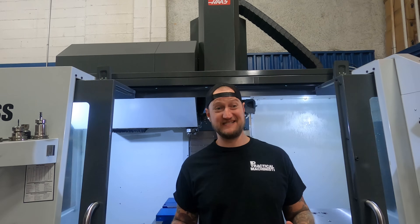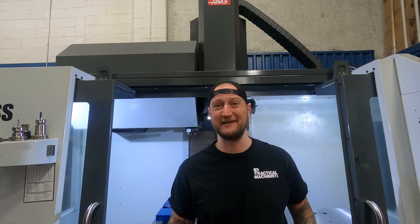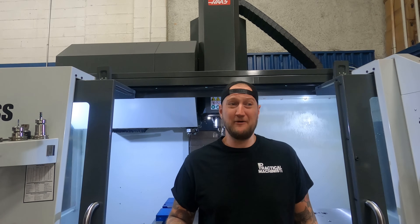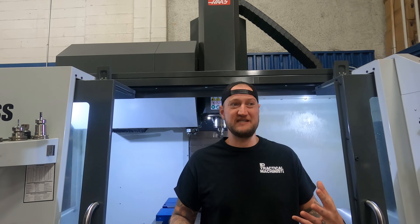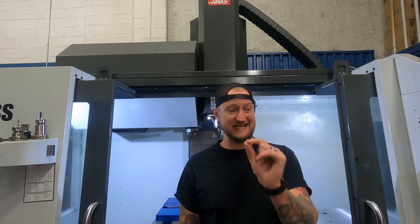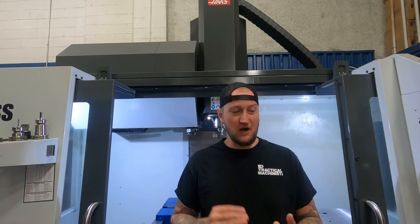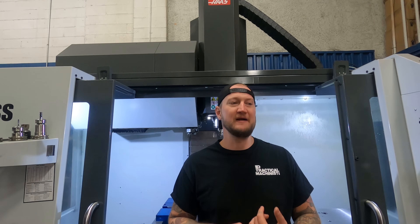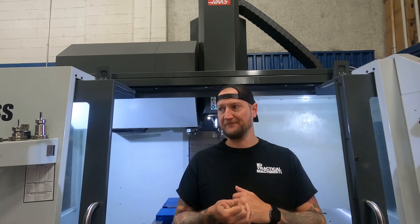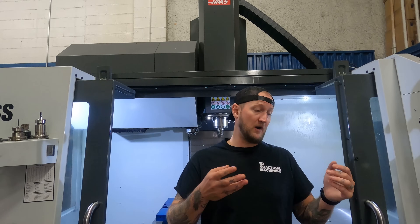So there you have it guys - I hope you enjoyed this. This was a very, very crazy result in my opinion. Thank you Iscar for providing this super high-end tooling to make this happen. But it goes to show - when I got the speeds and feeds from Iscar for these, I thought they were optimistic. In a standard tooling application you can always get these speeds and feeds, but whether they actually survived the tool test or not is a different thing. And clearly we can see they did - even that one insertable with those tiny, tiny inserts. I was shocked at how quickly that went. We're not saying there's not a place for something like a dynamic mill or an adaptive clear. It's that if you're always relying on it or you're always thinking it's the best option, you may actually be losing cycle time or material removal rates that you could have at a higher level with a more traditional toolpath with something like an insertable end mill or an exchangeable head.